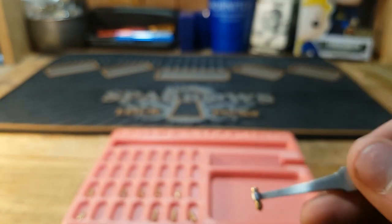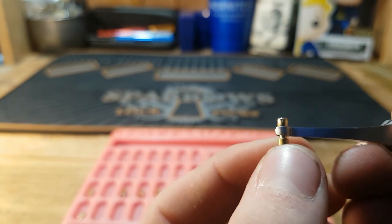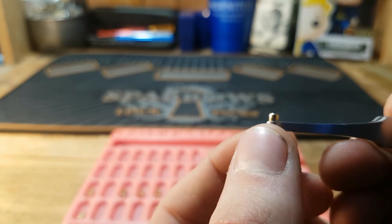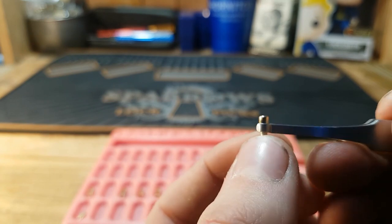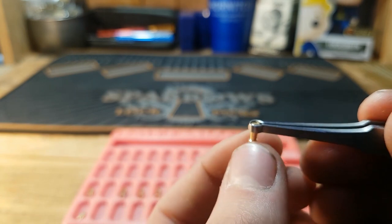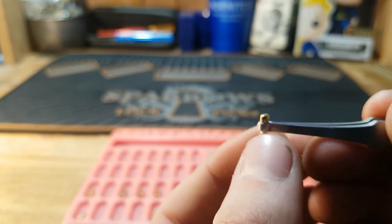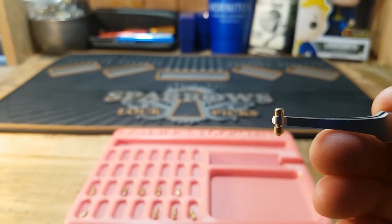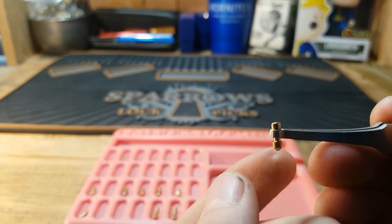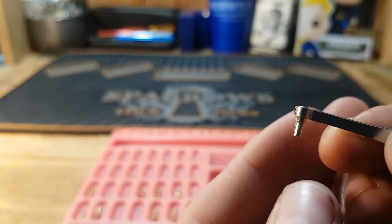This pin is great for use in the core as well as up in the Bible. The next pin we're going to be making is a torpedo pin — the name comes from it looking like a torpedo. This is really only used in the core as a key pin. Pretend my tweezers are the core: if you bump this while picking, it almost wants to scoot right up and over-set itself and is very hard to drop back down.